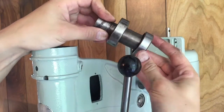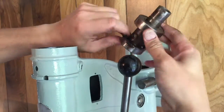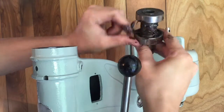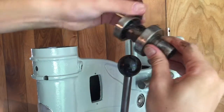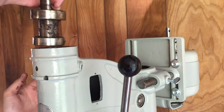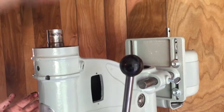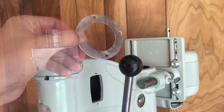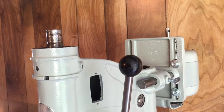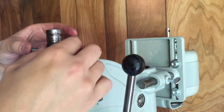I'm going to go ahead and reinstall this pulley bearing. First I'm going to pack some fresh grease into these bearings, then put a bit of grease around the sides so I can just drop this into place. Now let's put on the plate that holds the bearing in place — I'll put a few drops of oil on that to keep it from rusting.